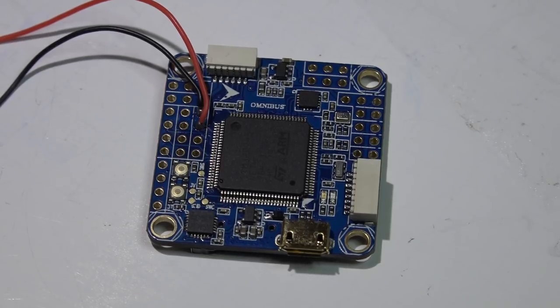I'm going to show you how to power the Omnibus F7 flight controller, power your receiver with either 5 or 3.3 volts depending on which receiver you have, and power your camera and video transmitter. We will cover everything in one video.